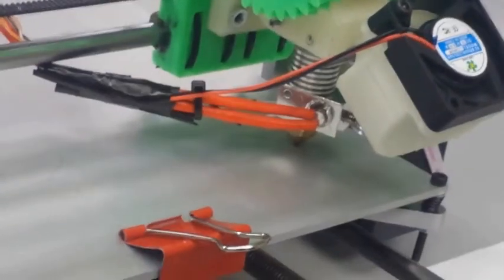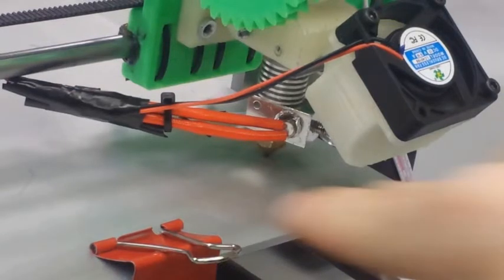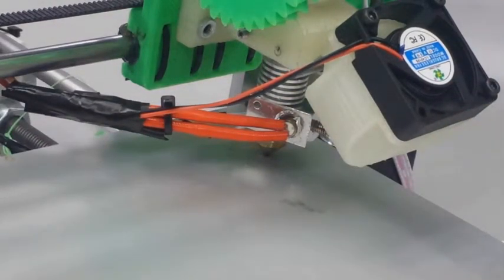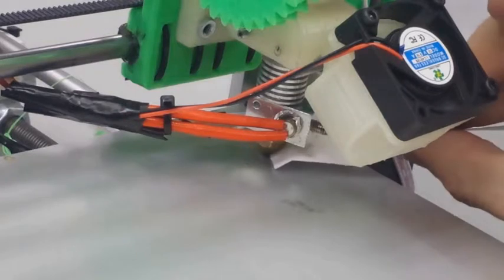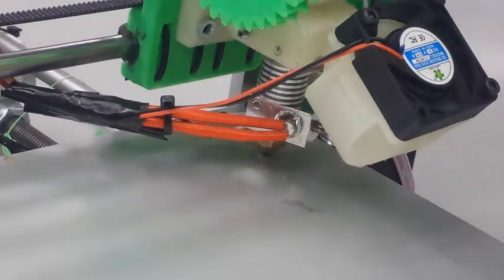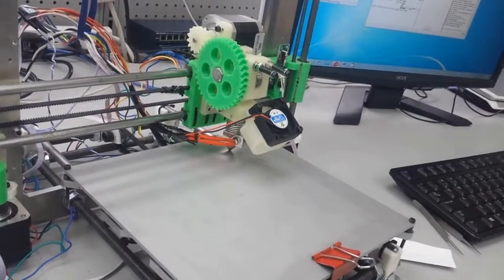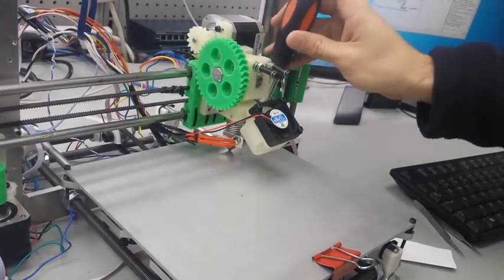The way to do this is just like you see me doing. I'm moving around to all four corners to make sure that we're in the same starting point. Because that's the tricky part here, is you want to keep your height completely equal across all four corners. And right now I've achieved that, so we're in a good position right now.